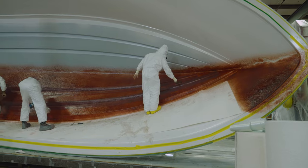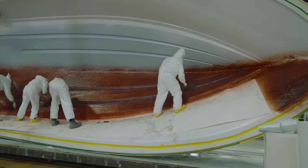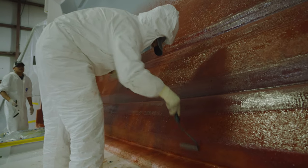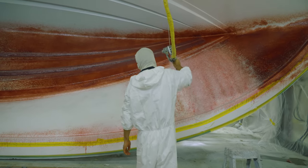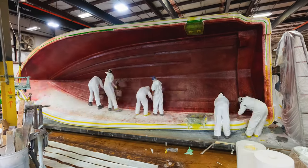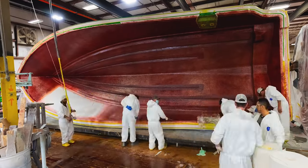The gel coat layer is followed by a skin layer. This layer plays a crucial role in every fiberglass part, as it is the first line of defense against water penetration. In infusion, the skin layer plays a key role in achieving a smooth, finished surface. Skipping this step would result in what is commonly referred to as print. Printing is when the ghosted texture of the woven fiberglass appears in the final part.